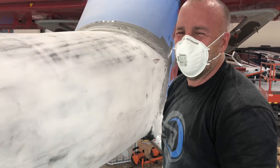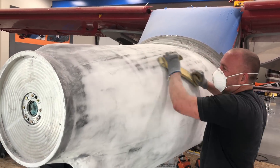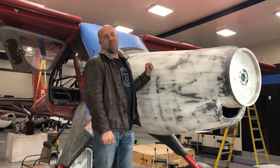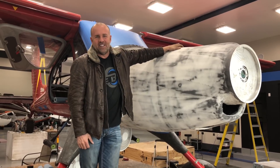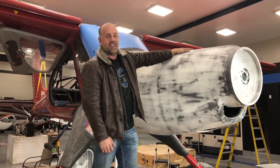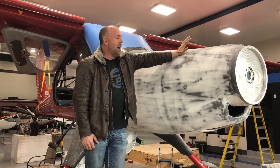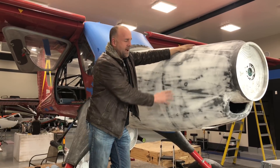We're only about four hours in, about ten hours to go. That's a fun job. My arms are shot sanding this. I put about a quarter inch of micro bubbles on the whole thing and then brought it down till the carbon started to show up. I'm gonna leave it at this state - I got a lot more sanding to do to where it's almost all carbon and little micro.